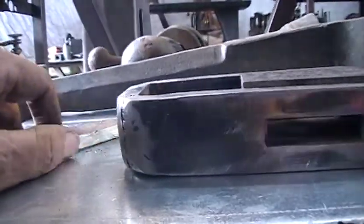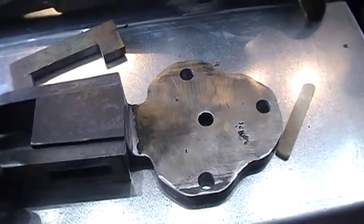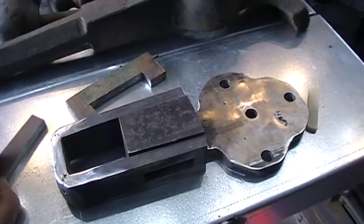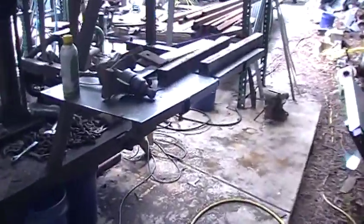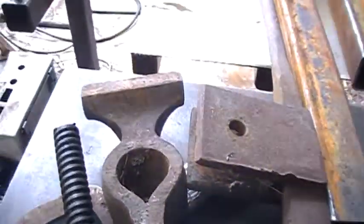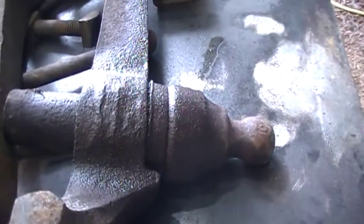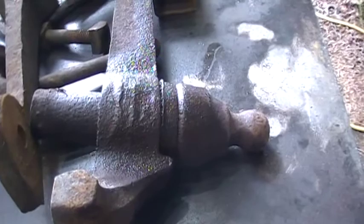This stuff is pretty heavy — a little heavier than they probably needed, but it's what I had: some half-inch and some three-eighths. You drive it in there and it is stiff. I'm working on a third one over here. This one has the hollow nut — the big acme thread that goes into the square thread and holds the jaws together — and it's rusted up, frozen on there. I've been squirting it with PB Blaster trying to get it loose, beat on it a bit with a rubber mallet.